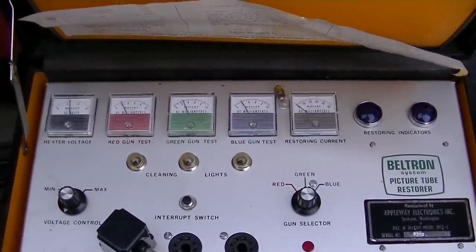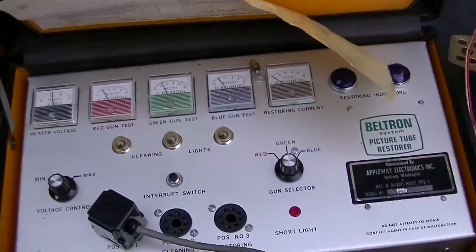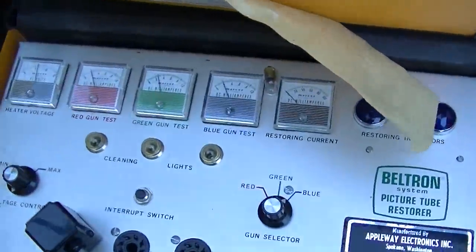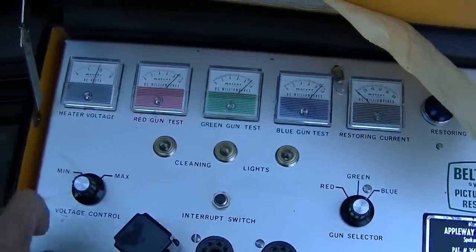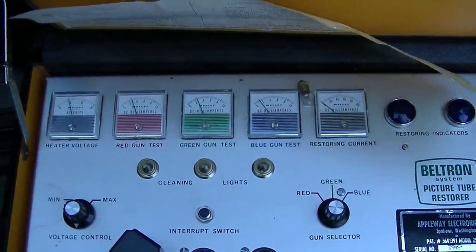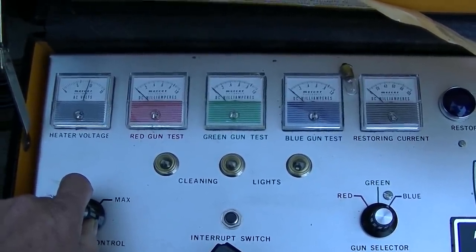Well, interesting. I let it sit about 5 minutes and they went up to about 0.8. I came back 5 minutes later, so 10 minutes, and they had dropped down. It's like the CRT tester is burning what little is left away. So unfortunately, I think this is destined for the trash can, like the black and white one. I don't need to keep any more junkers around here. I'm running out of space. And cleaning or rejuvenation doesn't last. I've tried it. It might last a day or two. I don't think there's much to clean. I don't think there's much left.